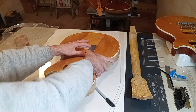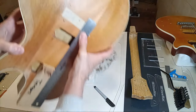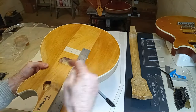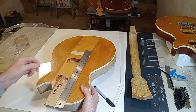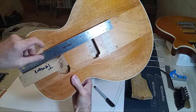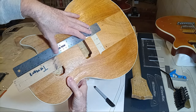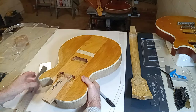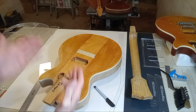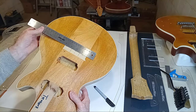Make your pin mark there and then make your pin mark right there — I use a micro pin. You might not be able to see it because of the shadow, but then lay that over there and find that mark right there. That guarantees those two marks are parallel with the tenon. Now you can start assessing the actual tenon in relation to the actual or visual centerline.